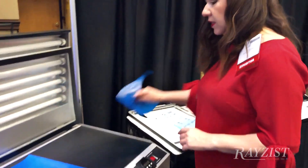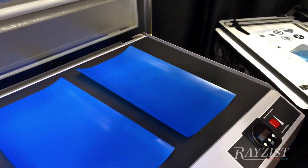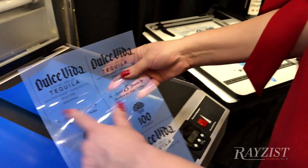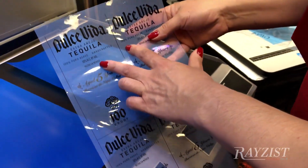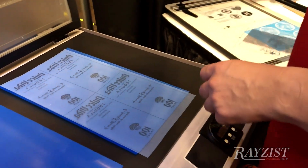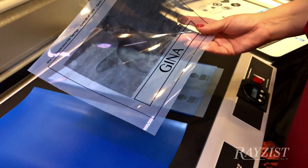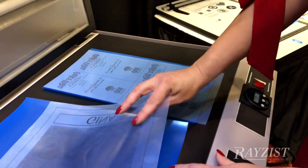I'm going to have two of my legal-sized sheets here of photoresist film. I'm going to take one of my designs — I have here some details, some bold lettering — and place that down on my photoresist film. Then I'm going to take my halftone image. This is great for halftones. We're going to place that down.